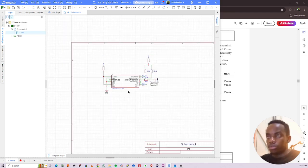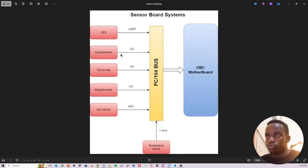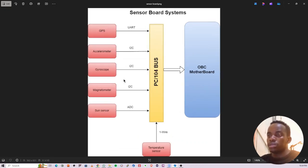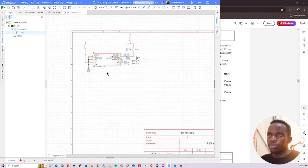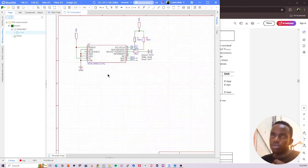Okay. So the next thing we design is, let's look at the temperature sensor. Temperature sensor is supposed to be easy because I will be using the LM35 temperature sensor. I had options. You can use a thermistor, you can use LM35, but a thermistor requires calibration. I don't want to do the calibration because you might get it wrong, because you'll be calibrating it on Earth. Unless you have very good testing conditions, use something that does not require calibration. So I'll use the LM35.